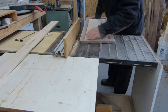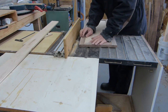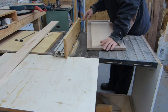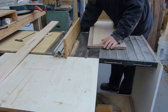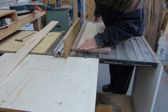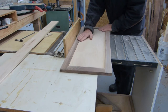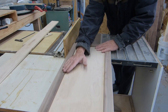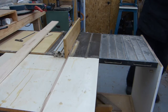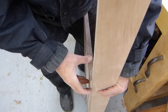We have to make our second cut. Common safety practice says don't let this cut-off piece get trapped between the fence and the blade because it could shoot back. Common sense says don't stand where it's going to kick back — if that piece comes out, be off to the side. And that came out very nice.